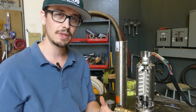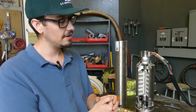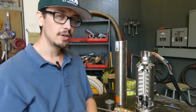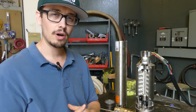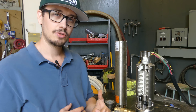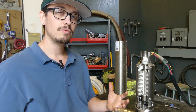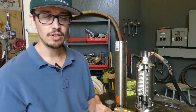There's also a fixed stage design — the most prominent example I can think of is Grundfos. Their impellers are stainless steel, their diffusers are stainless steel, and they're a fixed design that doesn't allow movement. Instead, they're just a really tough and durable material. So there are multiple ways to approach it. If you've got really challenging water — whether it has a lot of sediment or a lot of organic material — there's definitely a right pump and a wrong pump. But generally speaking, on relatively clean water, the difference between a fixed stage and a floating stage design, you're going to get similar performance out of either one.